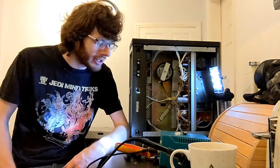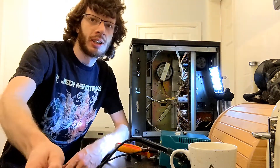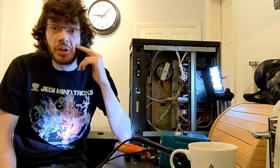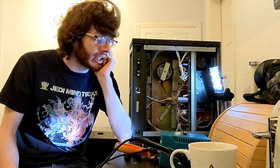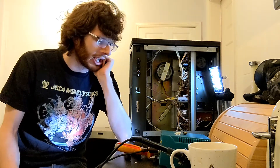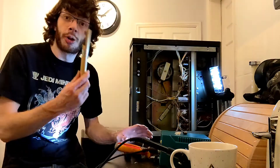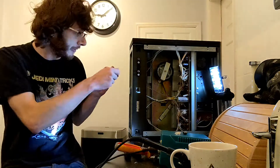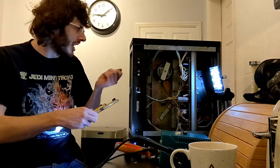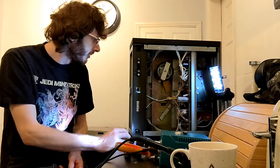Quick update: I'm about halfway through now. We've got a lovely pile of old electrolytic capacitors. I'm about to have a break for a minute — it's been a while, but going well. One inconvenience is my de-soldering iron died, so I'm back to using one of these manual ones, holding the iron on and using the pump. A good trick with these though is to splash a bit of fresh solder on first, because the fresh flux inside your solder will help. Ideally use a flux pen, but the odd dry joint I've put fresh solder on first.